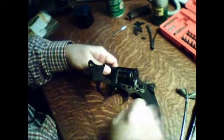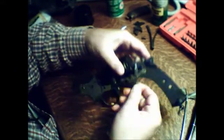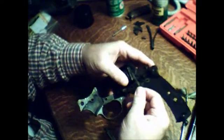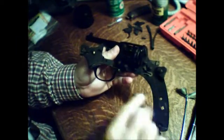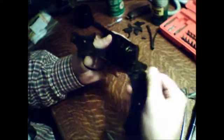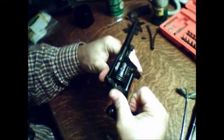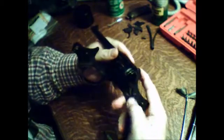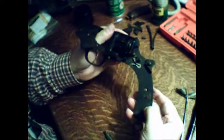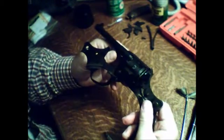So that's fine. And then next is number 4, which is our friend the trigger. So we'll take the trigger out. And there's the trigger is gone. And that's almost all the actual action pieces of the gun. There is one small spring that pushes against the latch, right, that keeps the cylinder from coming out, the cylinder latch. So I don't think I'm going to be taking that out. I think I can reach most of what I want to reach in here to do this.